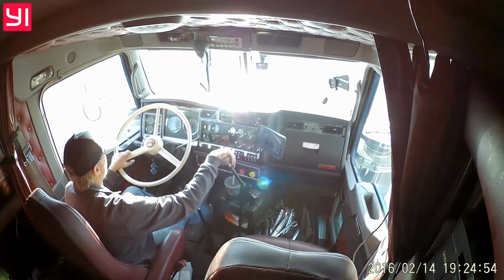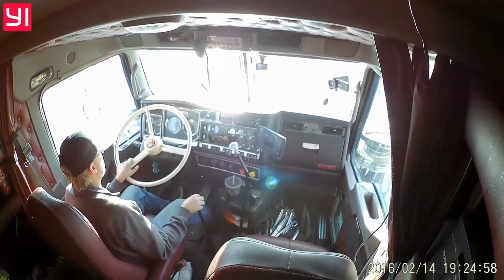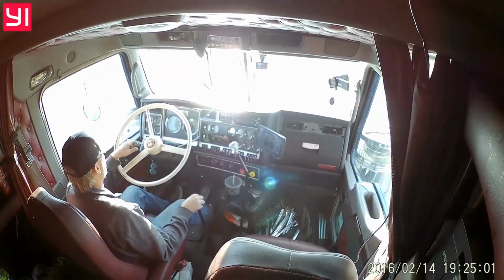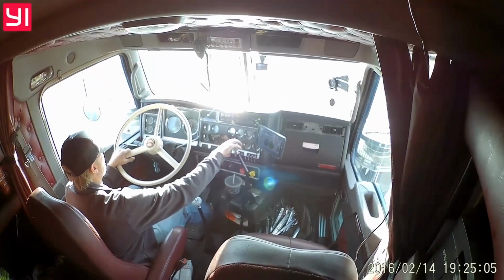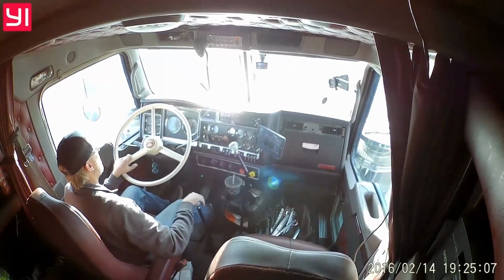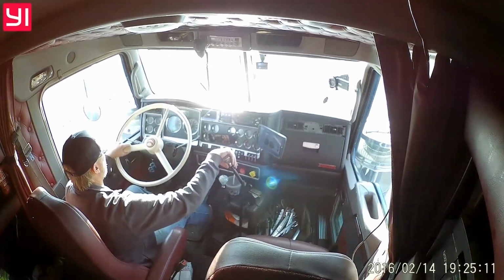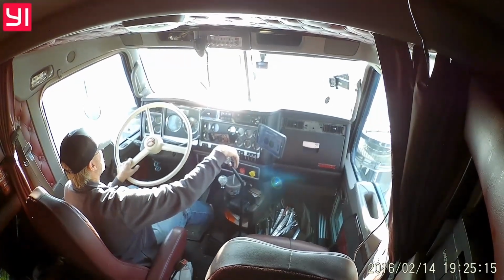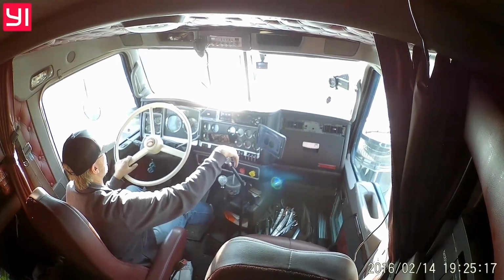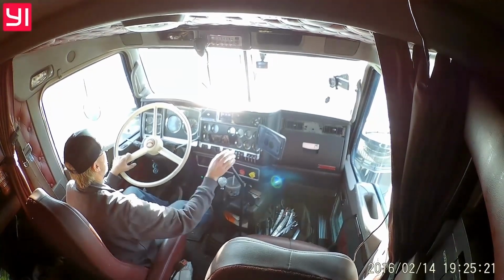I've driven a lot of old 13 speeds like that. When you forget, they'll remind you, because you get stuck in a neutral that you can't get back into a gear until you come almost to a stop. So you shift up into the higher gear first and then you split down, and it's pretty easy. Like I said, you get used to it when you're driving those old trucks. And they're fun to drive, those old 13 speeds.